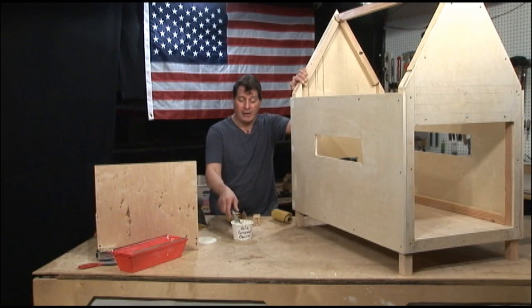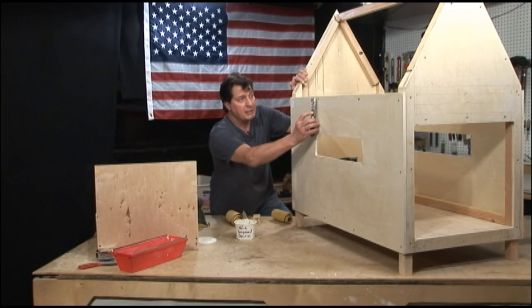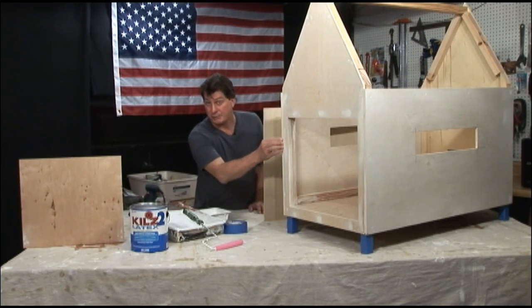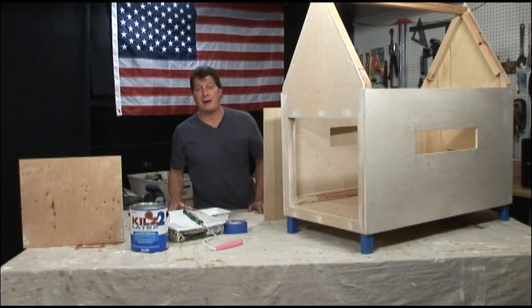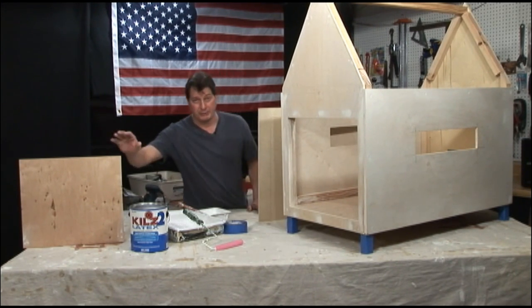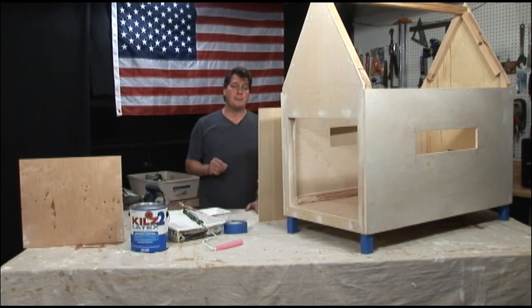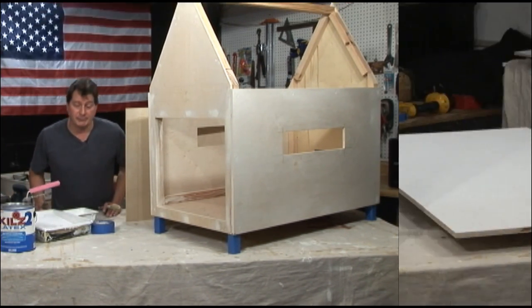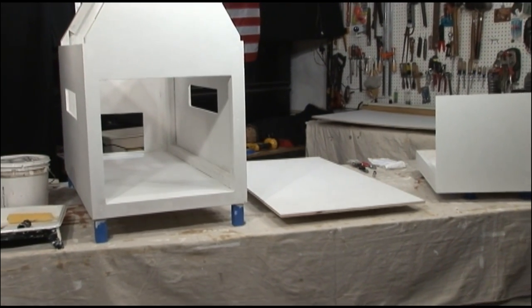I sanded down the whole unit — front, back, top, bottom, inside and out — with 80 grit sandpaper first, then finished with 120 grit. Now that it's all dusted off, I want to go back with some joint compound to hide all the imperfections like screw holes and seams. We filled all holes and seams with joint compound — better known as spackle — then went back with a light sand so the whole unit top, bottom, front, back, including tops and drawer, is sanded. We cover the legs with blue tape since we'll stain those later. The primer we're using is Kiltz, applied with a hot dog roller, cutting in the corners.